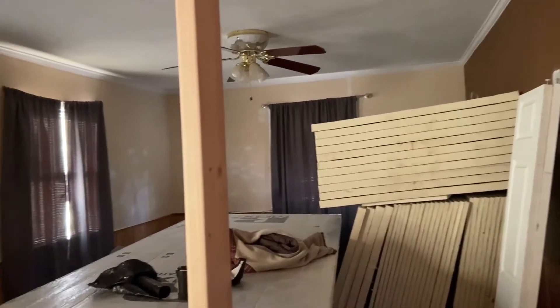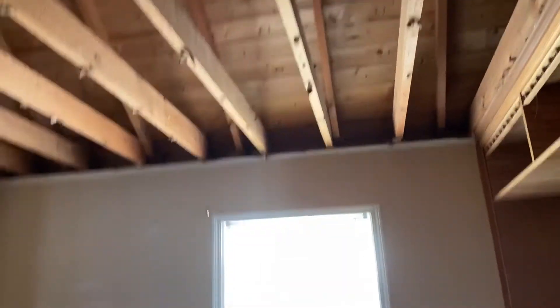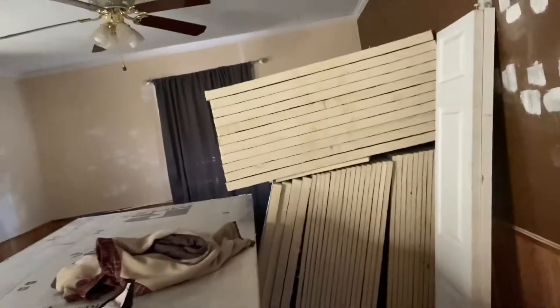Since these walls are drywalled, and I do know there's insulation behind them — there was a hole in one of them and I could see it — it looks more modern so I think that insulation is probably R13. I'm gonna leave these drywalled walls alone. The living room and the dining room seemed to stay fairly warm when we had our little heaters running before we took the ceilings out, so I think they'll be okay. One thing we will do is put some sound barrier on this back wall between the bedrooms and the closet, so that noise from the living room doesn't come through the walls and bug people while they're trying to sleep.